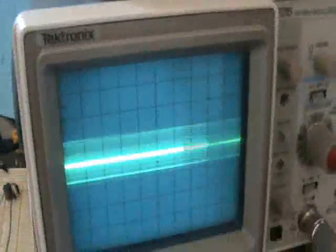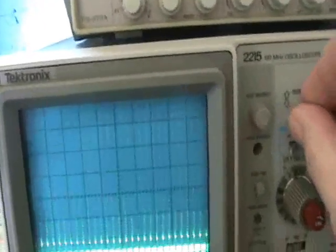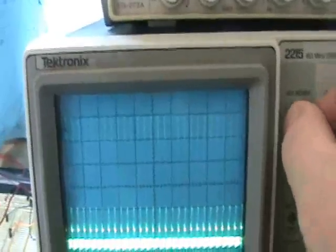This is the underlying oscillation with the scope set to one millisecond per division, so we're watching a blurring of all the heights of these waveforms. Now when I hook up the plate antenna — which is this thing — to the coil, the capacitance changes and we can see these higher radiant spikes above that baseline oscillation.